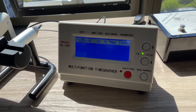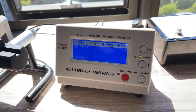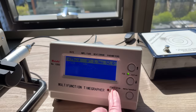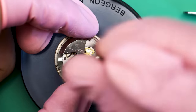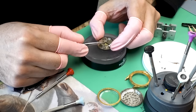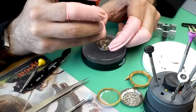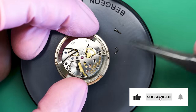Oh no. Yeah, this is rough. It's losing somewhere around two minutes a day. And the amplitude is reading at zero — obviously it's not actually zero, otherwise the watch wouldn't be running at all, but it's not high enough. It had that snowflake, lost-in-a-snow-globe look to the reading. This thing is running horrendously bad. The amplitude was so low it wouldn't even pick up a reading. So at least a cleaning and service is going to be needed. Hopefully that's it, but sometimes as you go through, you find it needs more.